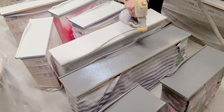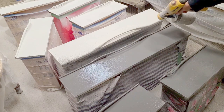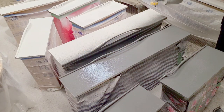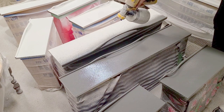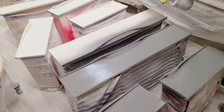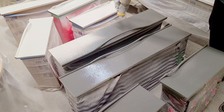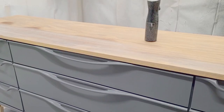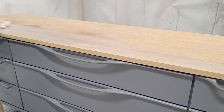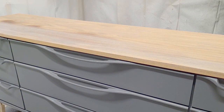Once that was done I sanded in between coats and then started to spray my paint on. This paint is called Anchor, by Cottage Paint — it will be in my description. It is a very dark gray, and in my pictures it actually came out a little bit blue, like a bluish gray, but it still turned out really pretty and I loved how it looked. When spray painting or painting with a brush, make sure you sand in between coats. I always sand with 220 grit in between primer and paint, then use around 600 to 1000 grit, and for the final top coat I sand with 2000 to 2500 grit paper.